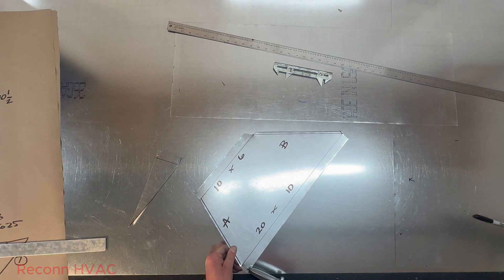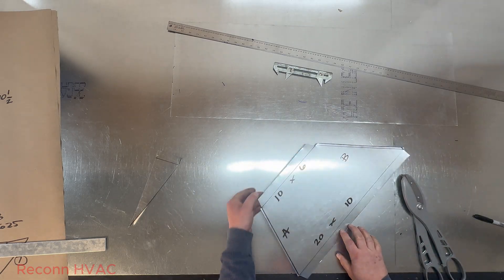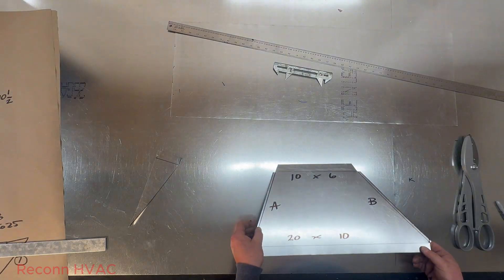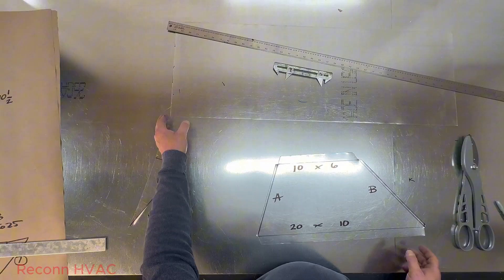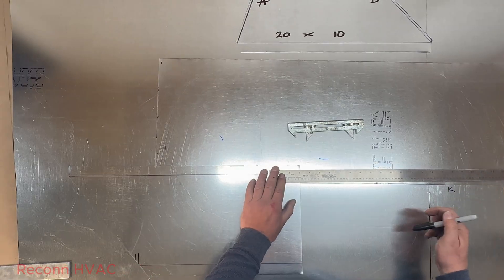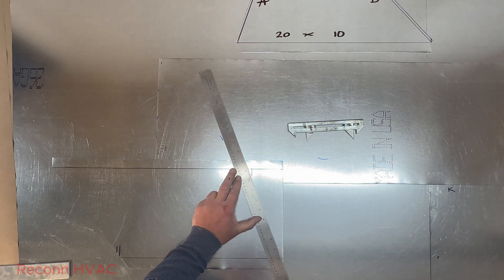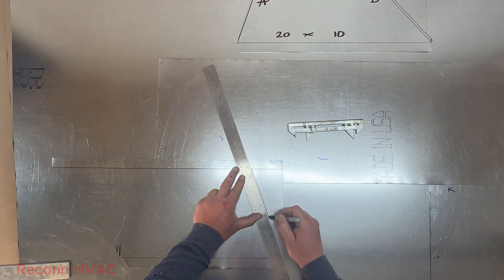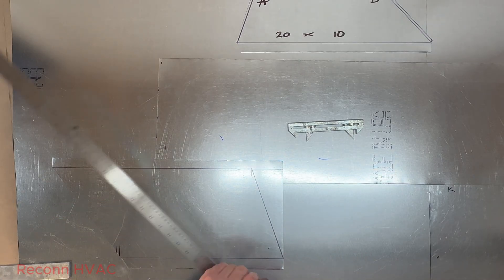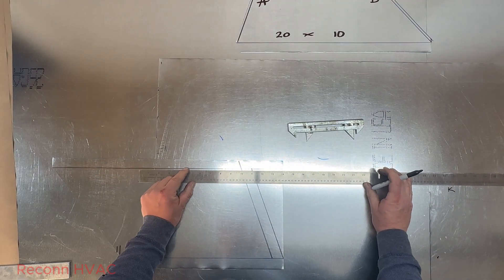Always cut 90 degrees to your lines — angle first, then slip. You don't have to angle these up, just cut them straight back. You'll end up with a fish hook there, and people say you have more fish hooks on your fittings than a bait store. So that's our first piece. Now we want to go to our other three inch side — we know this is coming up three. We're going to do our Pittsburgh on this side. Don't add anything in when they're really steep; just do it after the fact.